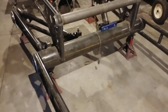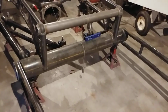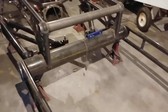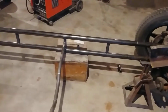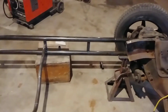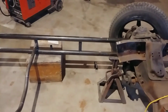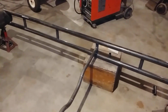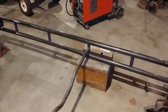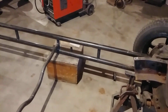Just to give you a little idea, I welded these on the under cab rails going straight. And I thought pulling them in 2 inches in the front here on either side, so that's 4 inches total, wouldn't be any problem at all. Well, a 1 inch ratchet strap couldn't do it anywhere close. It was amazing how much force there is. And so then I got a 3-inch wide ratchet strap, and it took all I could to get it bent or pulled, because it really is bowed.